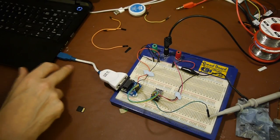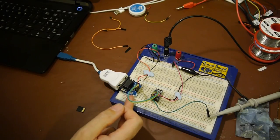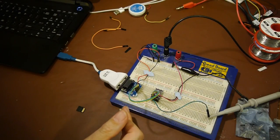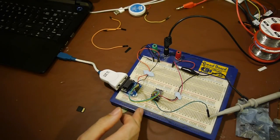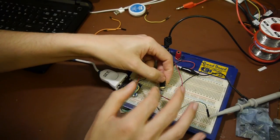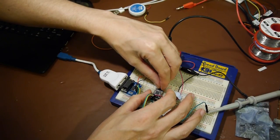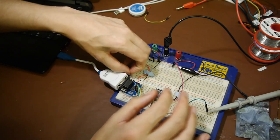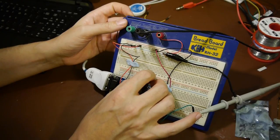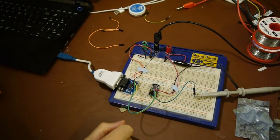To get some information to log I've plugged a USB to RS232 adapter into the laptop - it's a bit of serial madness: USB to RS232, then RS232 back to TTL, then into the logger. I'm running a terminal program on the laptop to squirt data into the Open Log. First, let's pop the SD card in - it's a bit fiddly. Right, SD card is in.